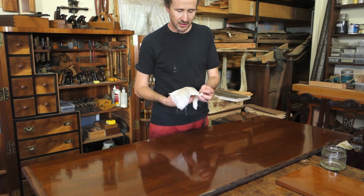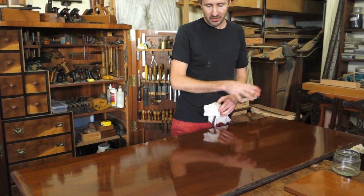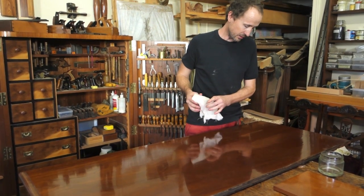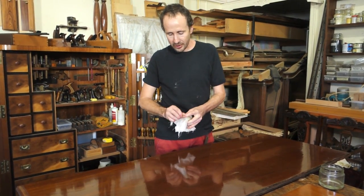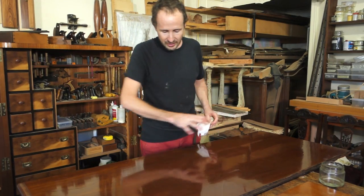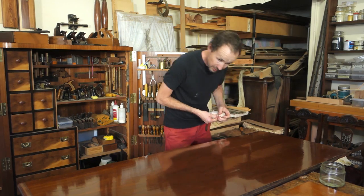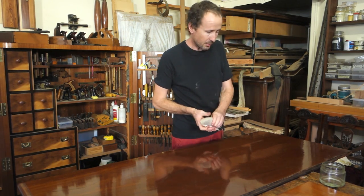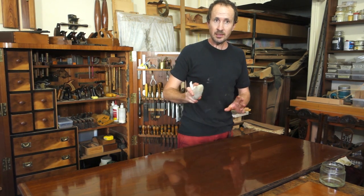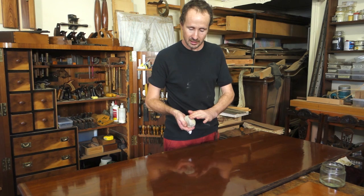So what I'd call the straightening or finishing stage — we've done our bodying and we've got a really nice build and a full body glossy surface. The finishing or straightening stage: we still have oil on the surface and we just want to make sure we remove any residue of circles from the bodying and the grinding stage. In the straightening stage, I like to use a separate rubber that I keep clean and with just metho in it. I quite often put a new bit of linen on it too.